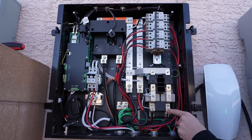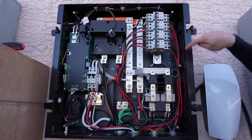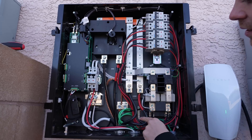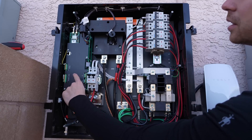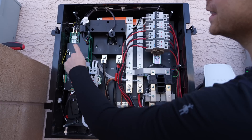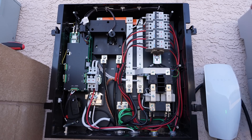You can connect anything you want here. The output goes up to circuit breakers and out to the loads. This is where the grid connects, and this is where your load center connects for your house. This is the communication system that talks to the batteries through CAN bus, and this is the communication board for remote operation with the app. Pretty impressive — it does make me nervous having this much exposed conductor at that voltage next to my face, but this is truly the brains of the system.